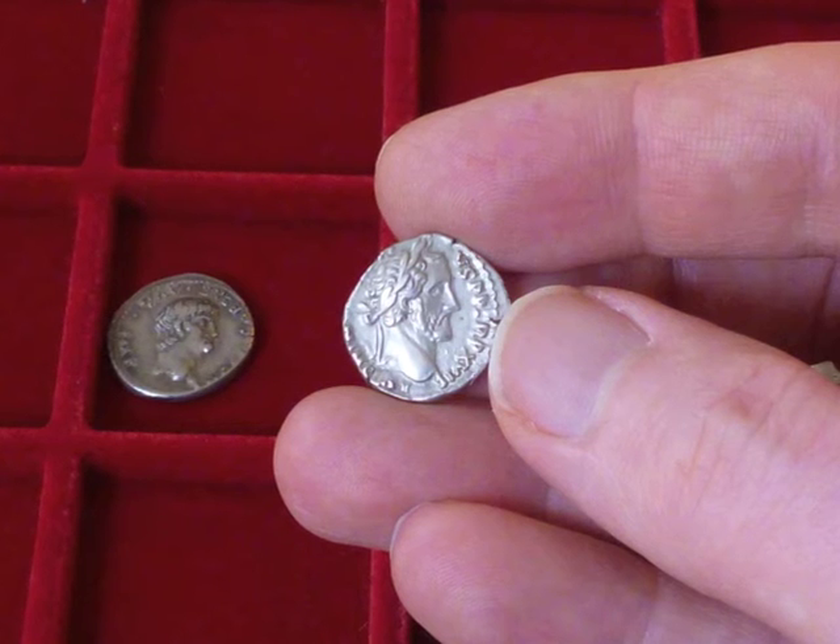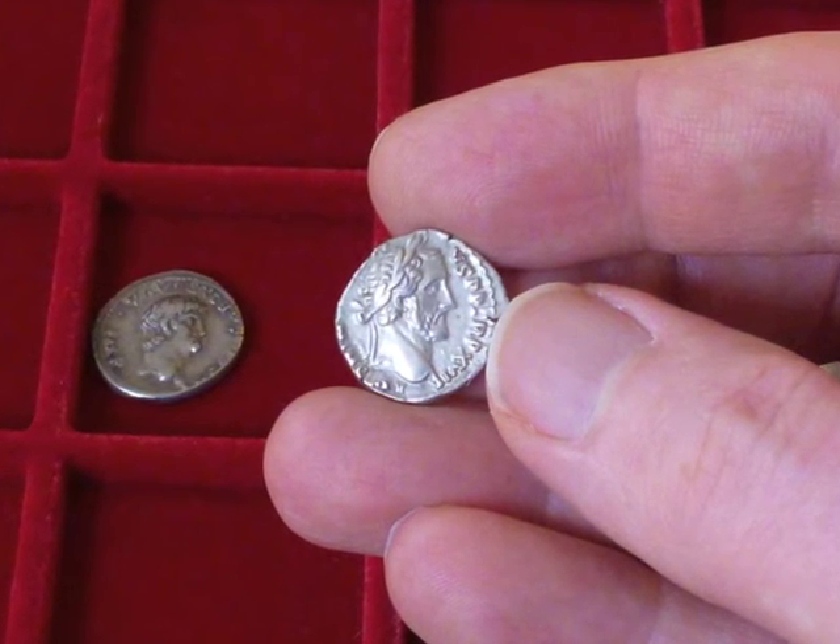So how to sample the heart metal of a coin like this without destroying it? There is no way of reaching the heart metal without doing some damage; the question is how to minimise it. One way is to take a sample using a very small drill of about half a millimetre in diameter, drilling into the cylindrical edge of the coin. The first millimetre or so of turnings are then discarded to avoid the enriched layer. Then the sample is taken from deep within the coin, where the effects of copper depletion are at their least. The drillings are then removed for analysis.